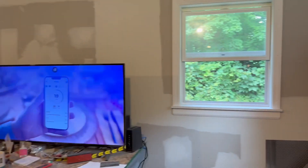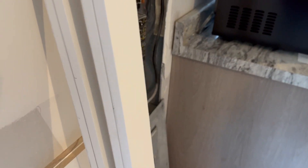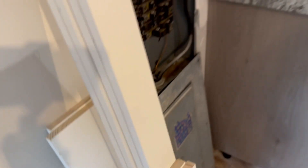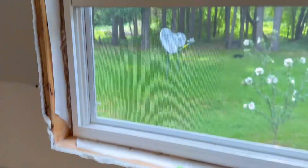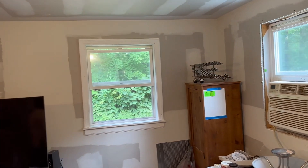It was getting dark and late, so we still have to pre-make all the apron pieces — that's this part right here. We have to make 11 of those, plus the three specialty windows. There are three windows that are different. We got the tall escape windows here; they have different width on the jam and everything. We're gonna use a full five and a half inch window sill on those tall windows so the cats can sit on them — cause Stewie's so fat. And then here's the baby window — we only did the jam, because once the jam's together we'll know exactly how big the casing's gotta be.